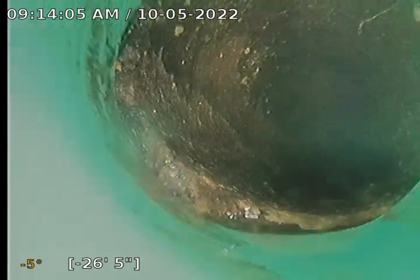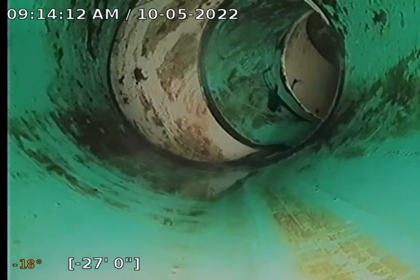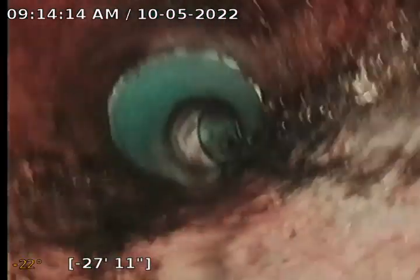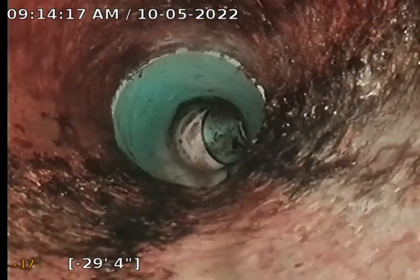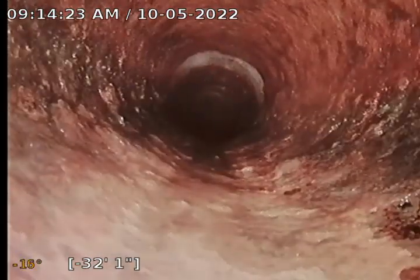So about just literally right outside the water. That being as close as it is, that kind of helps create a perfect storm situation where you don't have any weight behind it. The root comes in there, and then now we're back in the cast iron pipe after that PVC. It's cast iron all the way back to the clean out here.